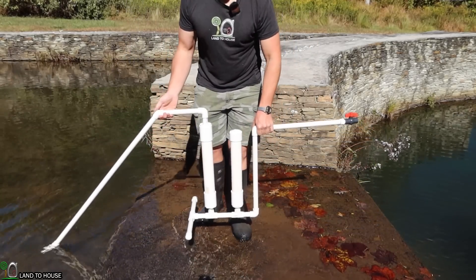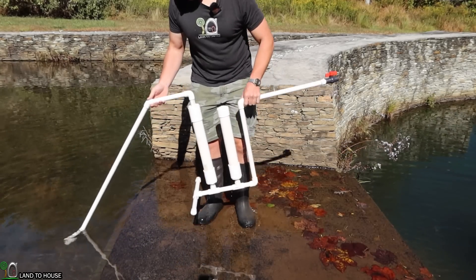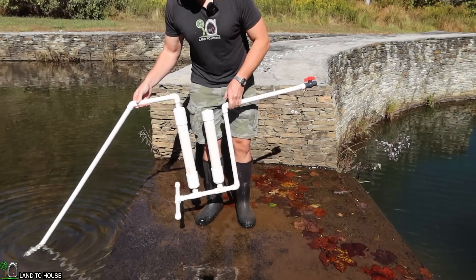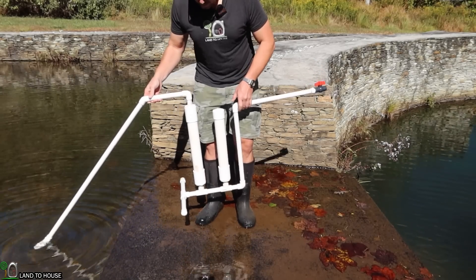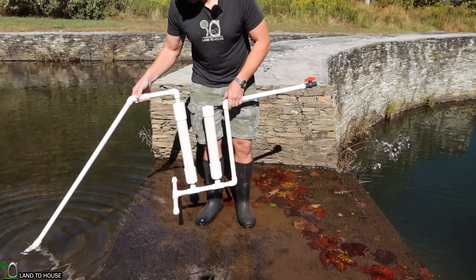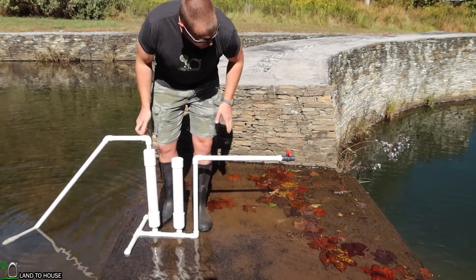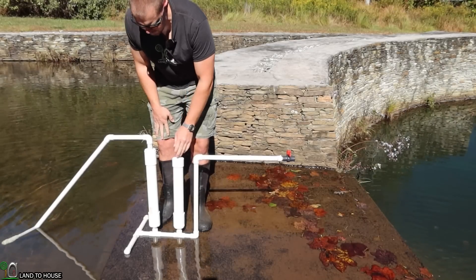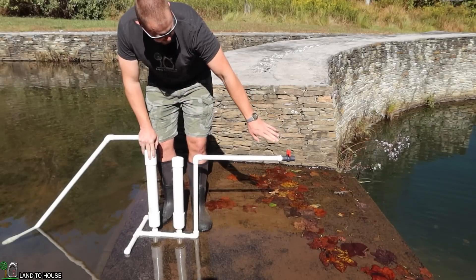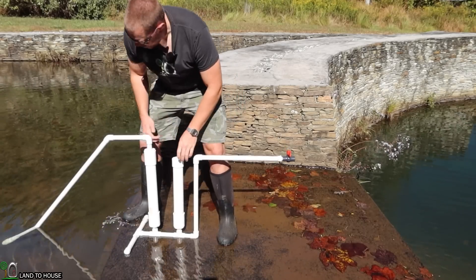I've drained the system. I'm going to keep this valve open and keep the pump — or siphon, whatever it is — upright and just pop this other end into the water until water starts coming out the top. My thought is if I keep this upright, then water possibly won't fill this pressure tank and it'll build pressure. Two hours later — the system is now full. I'm going to close that off and do this a few more times to see if I can build any pressure. In that video it just surged out like nobody's business. I still think it's not going to happen, but let me give this 20 or 30 more primes.